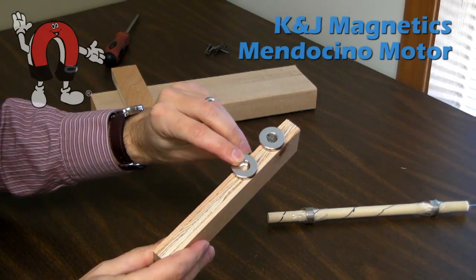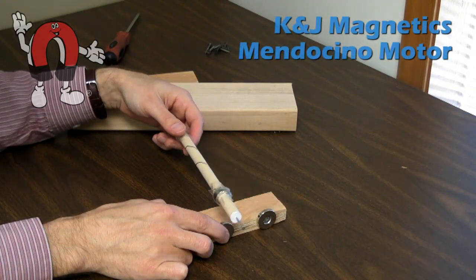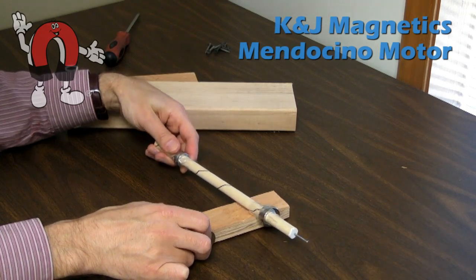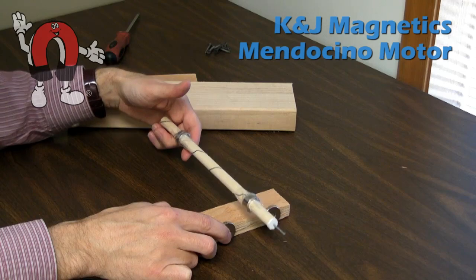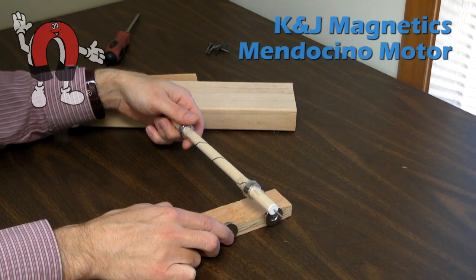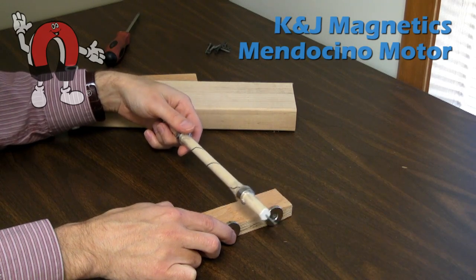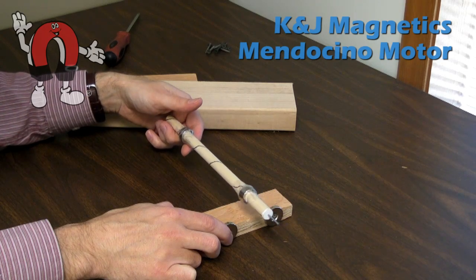The question is how far apart should we place the magnets — very close, very far, what is just right? You find that closer together it tends to push the shaft up higher, but it isn't quite as stable and tends to tip over to the side. Farther apart and it won't support as much weight. Somewhere in the middle provides a nice stable pocket where it will sit, while still giving enough upward force to keep it suspended. Experimenting by hand is really the best way to figure out what distance will work with the magnets you choose and the weight in your setup.